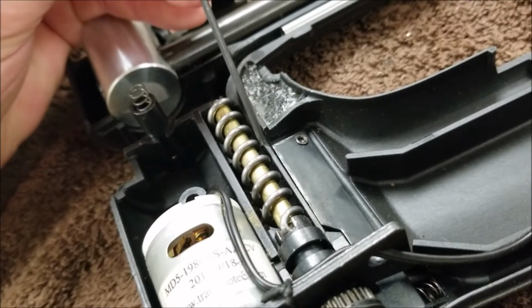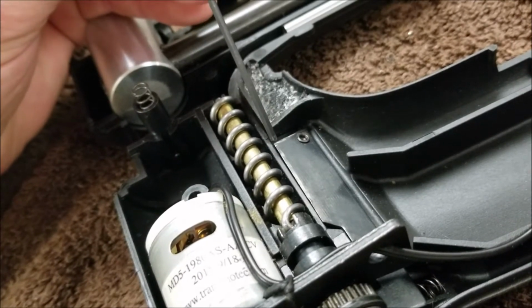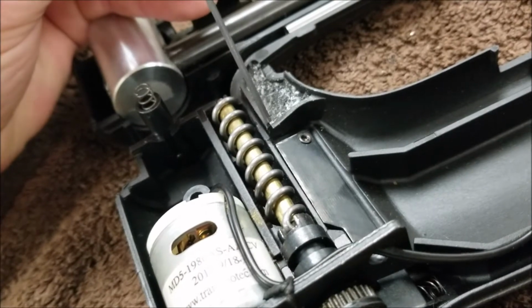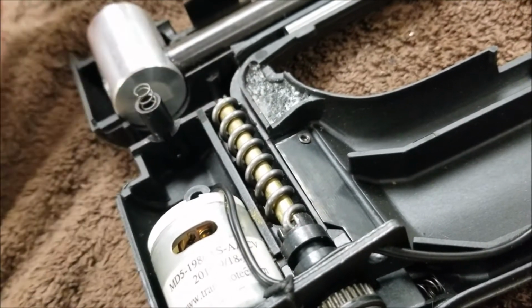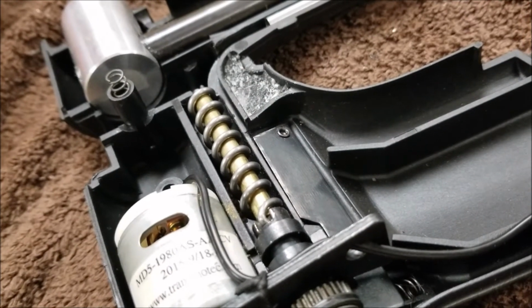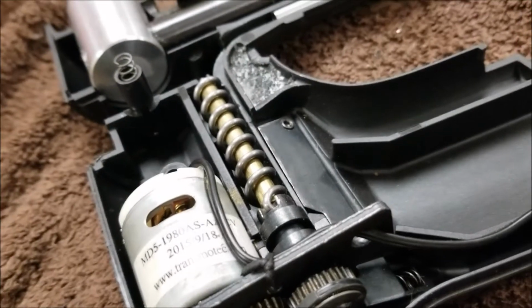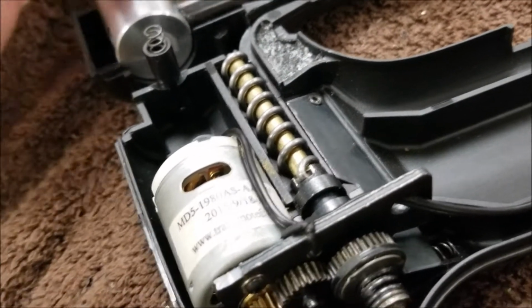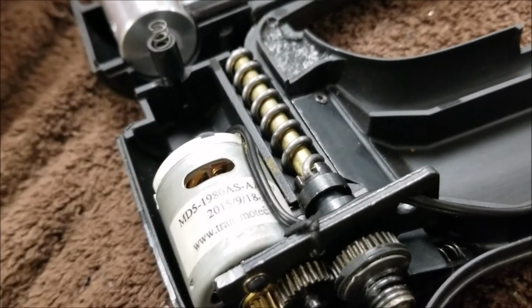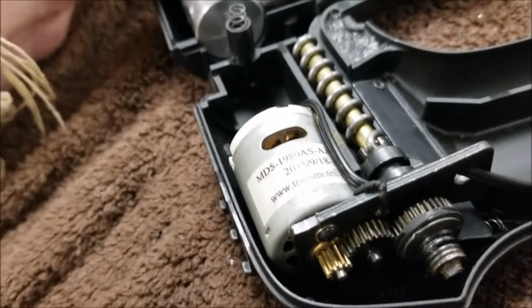So that spring, the shaker unmodified, and this corner can give you 3 points of contact. And you don't want 3 points of contact. That's why I ended up cutting these off, so you only have 2 points of contact. The reason we changed the size of the spring was to change the geometry in here. And it seems to be working out very well.